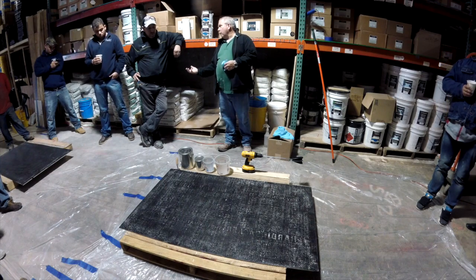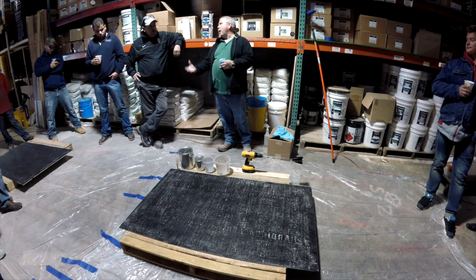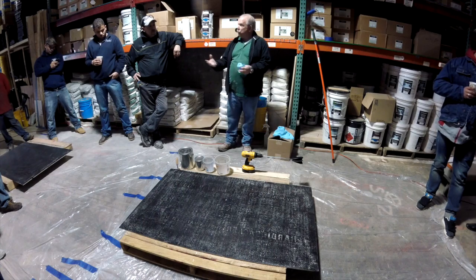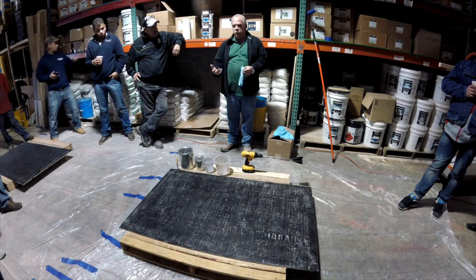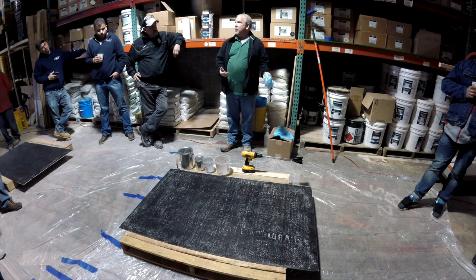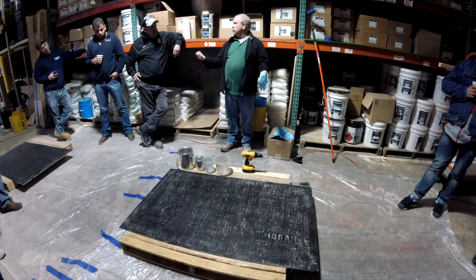Where now, once you put that moisture mitigation system down, you can get away with a lot more pressure coming up out of that slab. So that might be something you just want to consider doing because it's insurance, is what it is. When you're doing epoxy jobs, that might be something to consider, especially in basements, especially in areas where you maybe have old slabs where you're not sure whether they had a moisture vapor barrier down to start with. Like what you were saying, you had an old slab coming up. That would be one that you, yes, put it down.